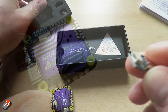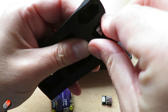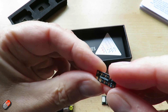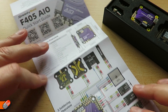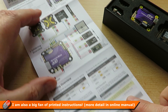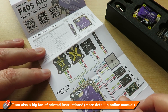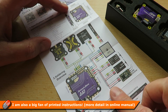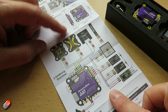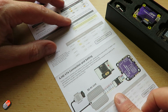This doesn't have a receiver built in - that's probably the only thing it doesn't have - however there are a lot of great setups in the manual for connecting a receiver, whether it's the TBS Crossfire system over CRSF, an ExpressLRS receiver with pads shown, or even SBUS and similar protocols. So if you're unsure how it all goes together, or where you're going to plug in your DJI or Walksnail stuff, the manual will hopefully give you a really good idea.